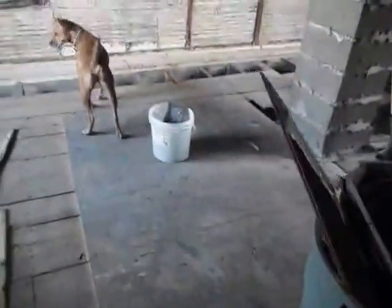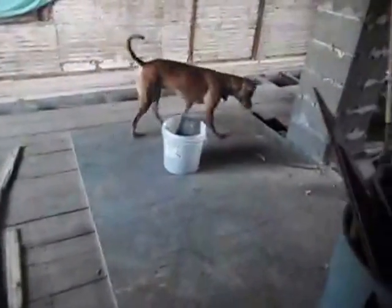The front door is going to go right in where that window is right there. Carl's here supervising. All the joists have to come up in this area — they are partially rotted, they are the wrong height, the floor is not level.